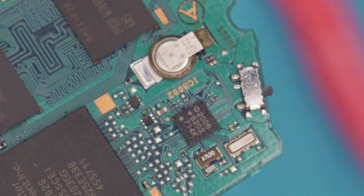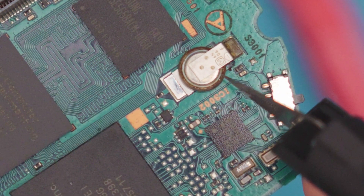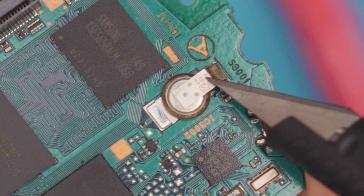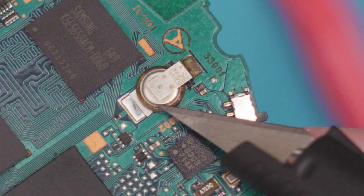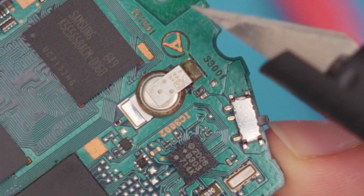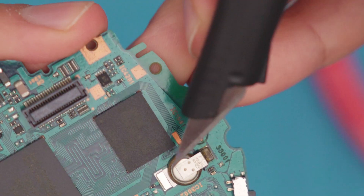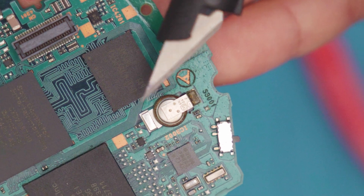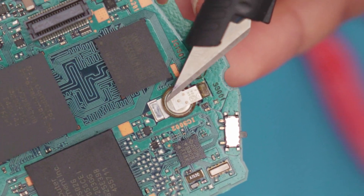Here's what we have. We have the supercapacitor, which as you can see is not doing too well — it's kind of spitting out its guts. The supercapacitor is the round part, and there's a clip on top held down by three little points. My method of removing these is to get the razor blade, get a nice sharp one, and be extra careful. You want to get right under the edge; if it doesn't work, try the other side. Just be mindful of all the chips around it — if you accidentally chip them, it's GG — time to get a new motherboard.